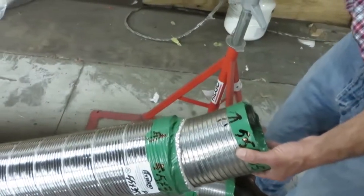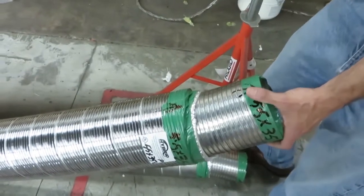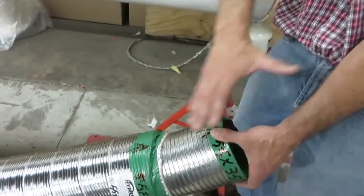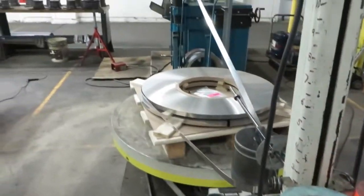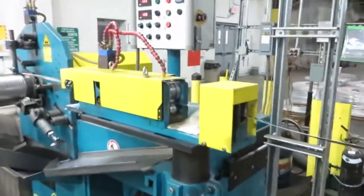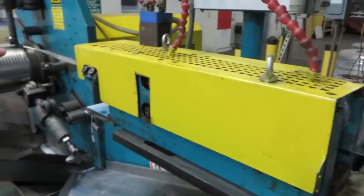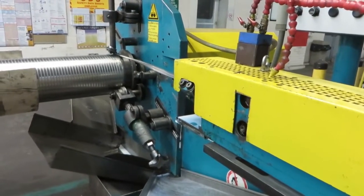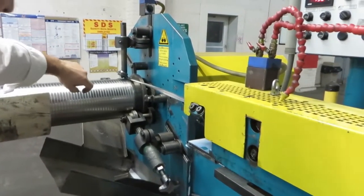The way we have to do it to maintain the listing is — because there's going to be a seam — you have to overlap the seam. Then he uses foil tape, smooths it, puts the foil tape on, then takes the roller and rolls over it to get it smooth so it won't come up. Then this shell is just slid over it. It goes through five stations here, and it basically comes out of the roll form, then it's creased into one another. So every time that thing spins, you're gaining that much pipe.